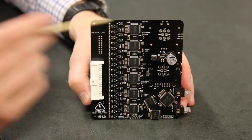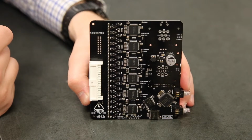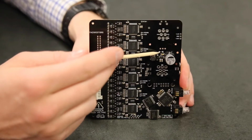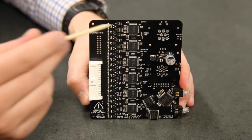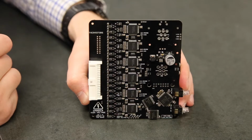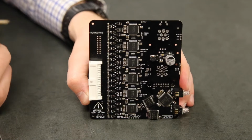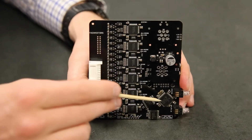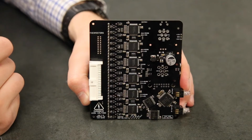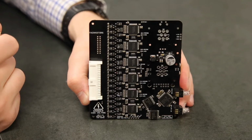You might have noticed this big electrolytic capacitor here next to the power supply circuit. That's not a filtering capacitor, it's actually acting as something like a backup battery for the circuit. On the other side of this diode here, there's a voltage divider connecting the 12-volt input to a comparator on the C2000. When 12-volt power is removed from the device, or when the bike is turned off, this capacitor keeps the C2000 alive long enough for the comparator to trip and the C2000 to command all of these BQ devices to enter a low power state. This prevents excessive current drain from the cells that we're measuring if the bike is left in storage for a period of up to 2 months.